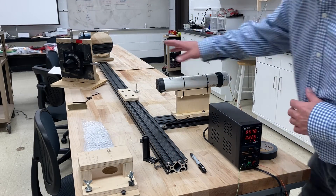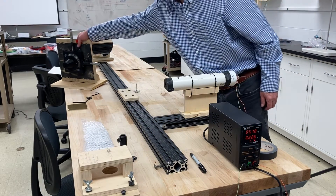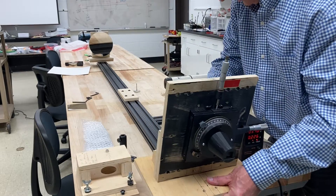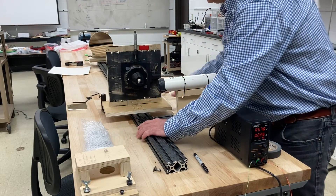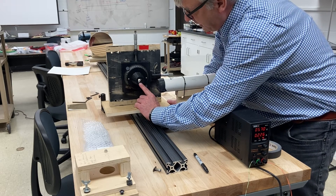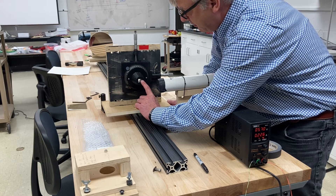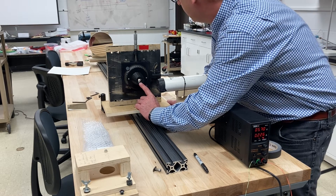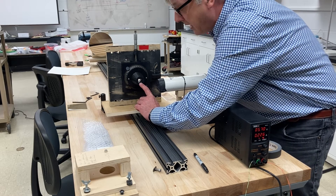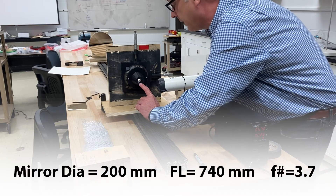Before I put this lens in its correct position, I'm going to put the Wollaston prism positioner in place. It's going to live back here in this position, and there's a hole here that I can put the Wollaston prism in and rotate it, so I'm going to be shooting the beam of light right through this hole, and the mirror is out there. This Wollaston prism is going to be exactly at the 2F position for the mirror, and I'll put some specs on what that mirror is.